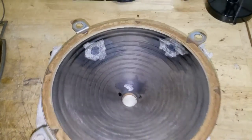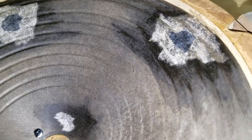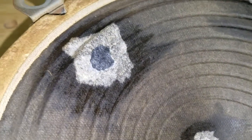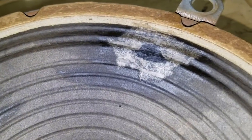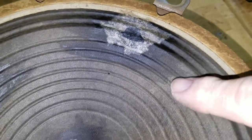Here's the speaker ready to go. I finished the repairs and if you look really close you'll see that this coffee filter material follows the contours of the speaker pretty well. You take your time and work with it a little at a time, starting on one side and working toward the other with the brush. After the Aleene's Tacky Glue dries you apply another coat — several light coats in a row — and then a slightly heavier spread at the end to get the material out a little farther around the repair.